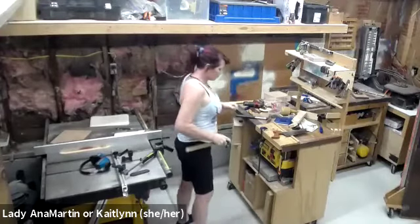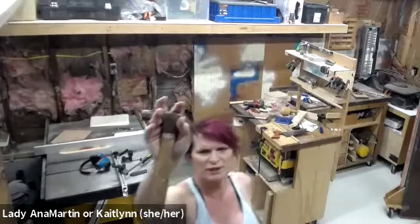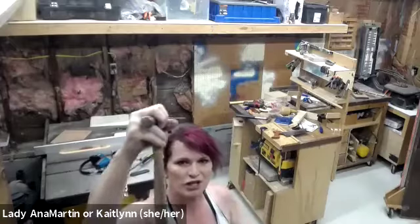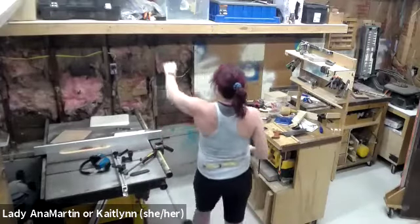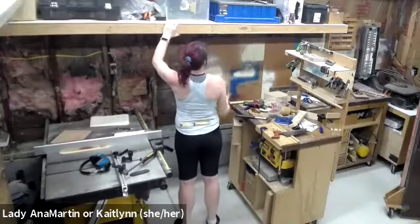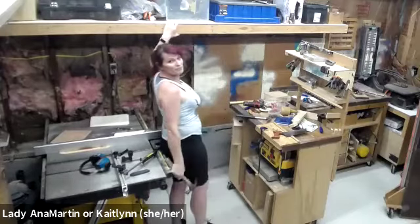Yeah. So here's what I'm going to do. I'm going to hold the hammer this way. And I'm going to grab the nail with the head up against the cheek. And then with one hand, I'm going to hang on to my work. And the other hand, put the nail in.